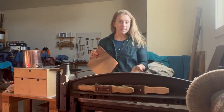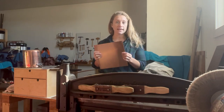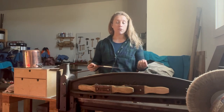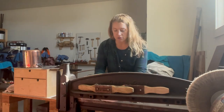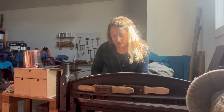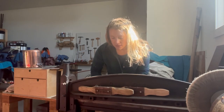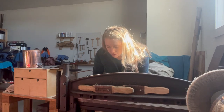Back to our stomp shears, or if you don't have a stomp shears, back to your heavy duty shears. The next thing we want to do after tracing out our circle is to cut the excess off. So in this case, most of it's on our corners. You're going to want to get as close to the circle that you cut, primarily because the less material you have to remove while you're doing it by hand, the happier and nicer it will be for everybody, you and the circle. So right now I'm just going to carefully start trimming any excess off, as close to the circle line as possible without obviously hitting the circle line. So that means getting some really tiny little triangles, without ruining the circle.